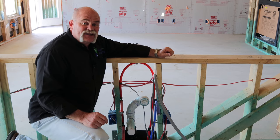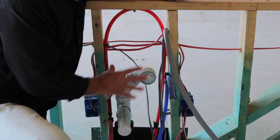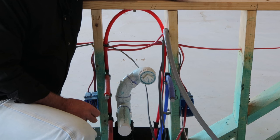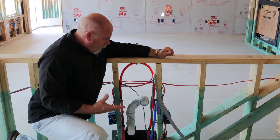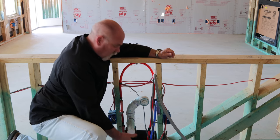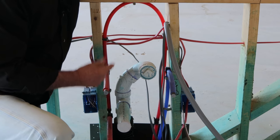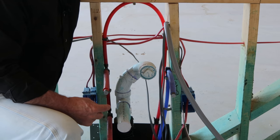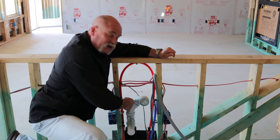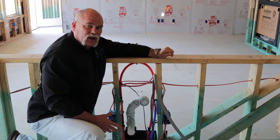So this is pretty cool — we're at the kitchen sink area. You've got an inch and a half arm sticking out for your kitchen drain and a two inch clean out plug. What I like about this is if the P-trap ever gets stopped up and clogged coming in this arm, you've got a clean out above it so you can pull the plug and run a sewer machine down through there. What I like about the way this is roughed in is there's not an arm in the wall — it literally goes straight in and straight down, so you don't have any horizontal line that could get clogged up.